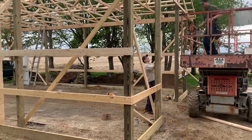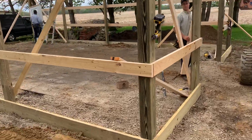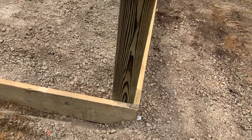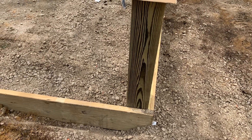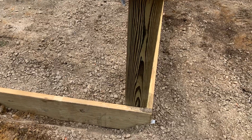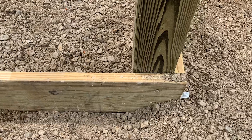You can see what they're doing there as far as measuring. What we did on this six by six — and let me take a look — yeah, six by six corner post. You can see that six by six corner post, and again we go down 54 inches. We put it on a 12 inch concrete cookie, and then we put uplifts — we run them east and west, north and south — two by six uplifts that way, which anchors it right into the ground.